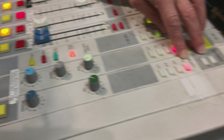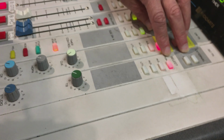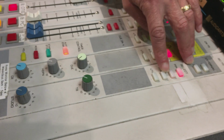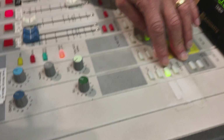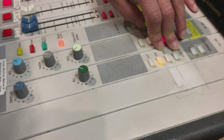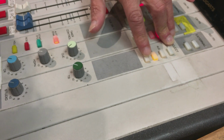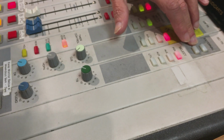What usually causes that is when all of the headsets for your guests are not working, it's because this module is not selected in program or audition mode. It needs to be in one of the two. For example, if I were to put this into an auxiliary bus, all the headphones are dead. Oh, yeah, the headphones just stop making noise. Same thing with utility, dead. But if I put it in program, it'll be fine.